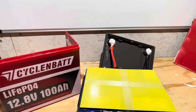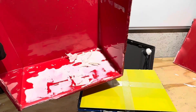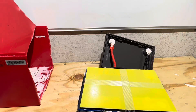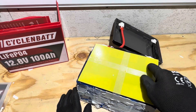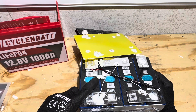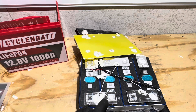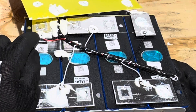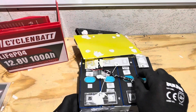That was probably the worst one ever to try to get into — very good build quality. The whole battery is sitting in like a mortar bed of sealant where there's no room around this case. There was no prying it out, so I had to saw the case apart to get it out. But I want to check everything out and make sure y'all are getting a good deal on this battery. Even the epoxy board has sealant down to the bus bars on the cell packs. Finally down into it, we can get to the low temp sensor and all that good stuff. There it is right there — the NTC thermistor glued down right in the center of the cell pack, right where it should be.